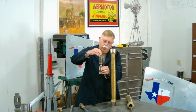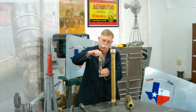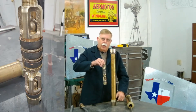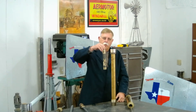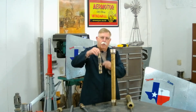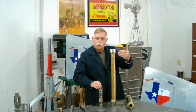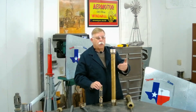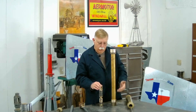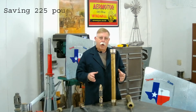This will drop on top of that one. If I turn it a couple of turns, it catches. Now I can pop out that bottom check valve and lift this whole assembly out of the well. That lets me clean both check valves, but more importantly, if I have to pull this out to service it for whatever reason, when I go to pull this pipe out, all the water is going to run out the bottom. I'm not lifting the water and the pipe together.